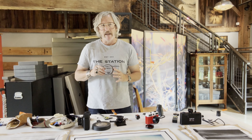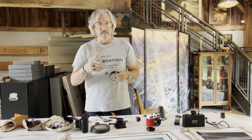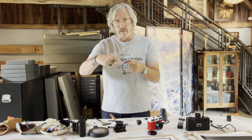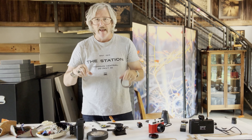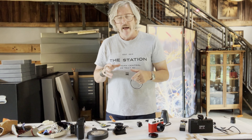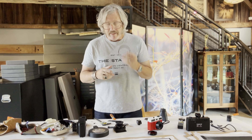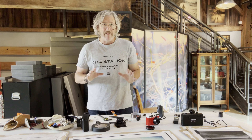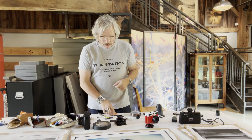You're also going to want to get some Teflon tape — I put a link to the one I bought on Amazon. A roll of the stuff lasts like a million years and it is invaluable. So many old vintage cameras from the 20s and 30s have rough surfaces inside that can scratch modern film. I just put a layer of this Teflon tape — it's very thin — on the inside and the film just flies over it perfectly. Same with many pinhole cameras I work with. In this camera, Teflon tape solved all the problems.